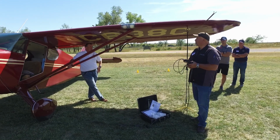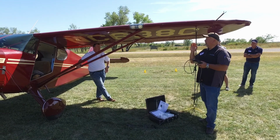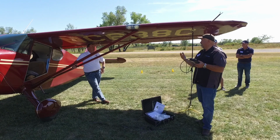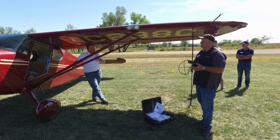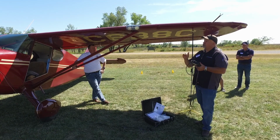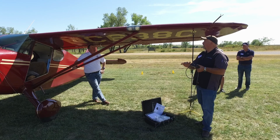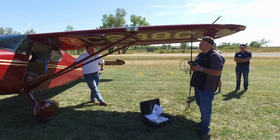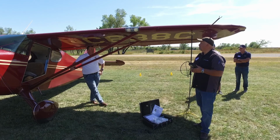For me, 0.13 is a really good starting point. And one of the things you'll want to do is move the weight to the back plate and run it again. And that's not something we'll be able to do today. But going from a 0.6 to a 0.13, when you fly it, you should feel a difference. That should be a pretty substantial improvement in the vibration level.